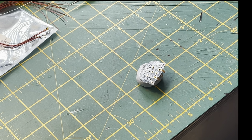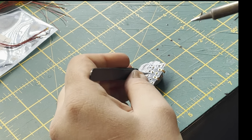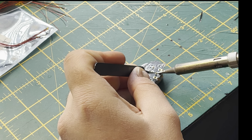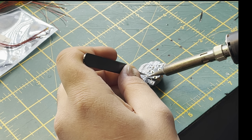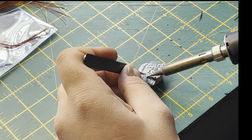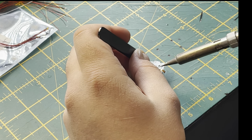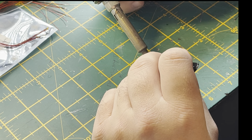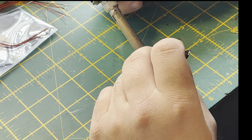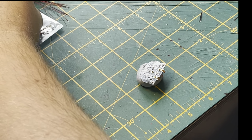Now it's a bit difficult to show you how I do this, but bear with me. Basically, I've got a big bit of blue tack. The PCB is just tacked on to the top there. I've got my tweezers. I'm just gonna, there you go, there's one LED off. As you can see, I just go either side. There's two. Just don't pull too hard on the tweezers, because you can break the top half off the LED. And there's three. So that's all the LEDs off now.